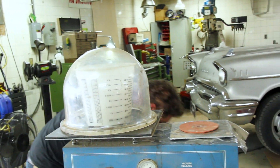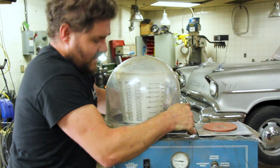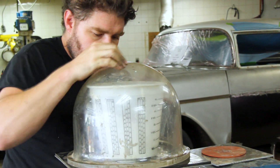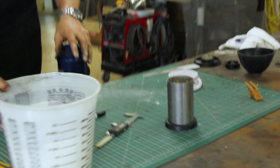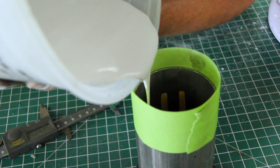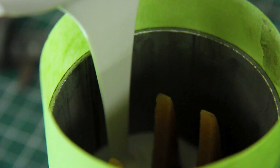This is a vacuum pump. It pulls a vacuum on our bell jar. All the little bubbles in here are getting bigger and floating up to the surface. It's not really bubbling much anymore. We have the plaster — you want to carefully pour it into the mold. I'm going to take a little bit of masking tape and put it around the mold so I don't have to worry about it pouring out. We want to pour the investment not on the wax but next to it, nice and gently, so it fills up and doesn't trap any air bubbles.